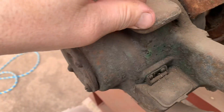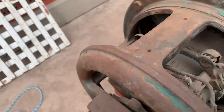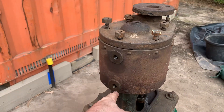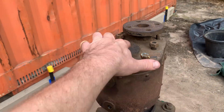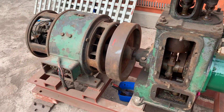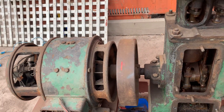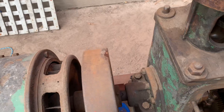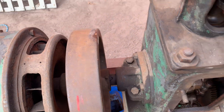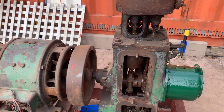There's a little bearing box — completely empty, as you'd expect. Those are your drain cocks. I would imagine the oiler on this was a hydrostatic — it's got nowhere to take a pulley off, so not a mechanical lubricator, although you could put one on if you could get a small pulley down in there. I've got a hydrostatic one somewhere I'll put on — I've been looking for a home for it, so this will do it proud.